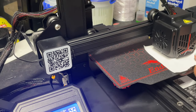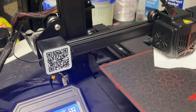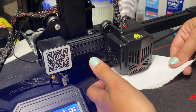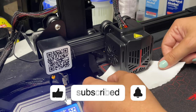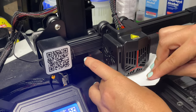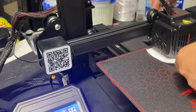Right off the bat this first corner is pretty good — I might do a little micro adjustment. Then we're just going to move the print head to the next corner and play around until we get that dragging feeling. Then we do the same for the other corners, continuing adjustments. Some corners need just a micro adjustment, others need a big knob turn. Also be careful because the bed is hot. I always do this process twice because typically when you adjust one corner it messes with another.